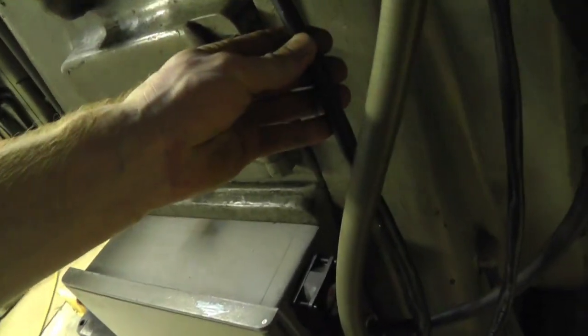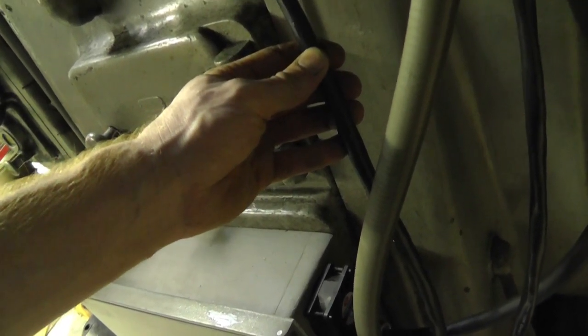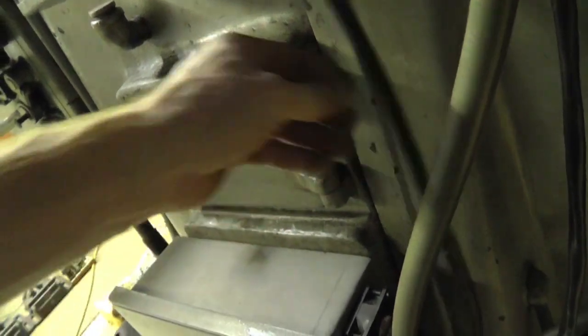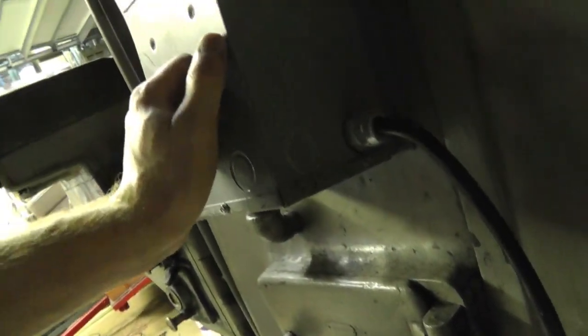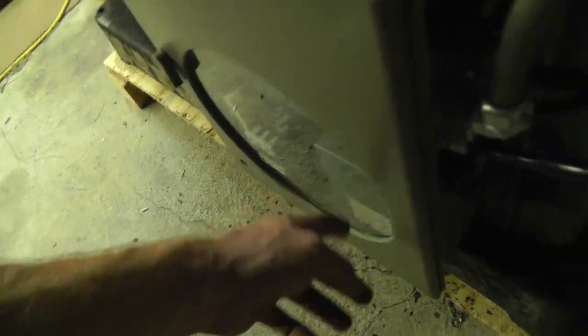Then there's actually like 8 conductors in here, I believe. 1, 2, 3, 4, 5, 6. 6 of them in here. So I'm pulling 220 back out of here and 460 back out of here. It goes back down to the drive and then feeds both of these drives. Well, the 240 volts goes directly to this drive, but otherwise this drive gets the 460 volts.